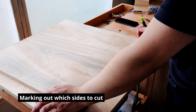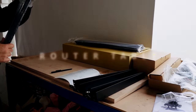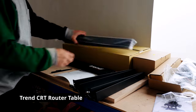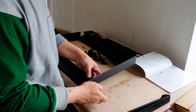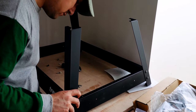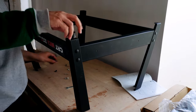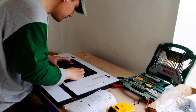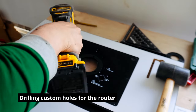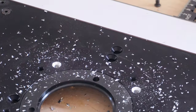The reason for this cabinet is to act as a stand for the next tool on my list, and one of the more important ones in my current workflow — the router table. When looking for a good router table, I could only find ones either dirt cheap with no real dependable accuracy, or ones in the £700 to £1000 price range. I couldn't find much in the mid-range. So I had to get creative, and I bought this router table by Trend for around £220, which has a lot of the features you would expect from a fully fledged router table. The only modification I had to make was to countersink in some custom holes into the base plate to accommodate my router.